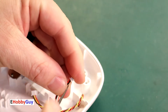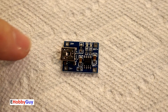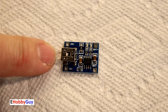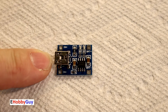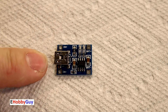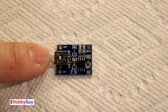I made sure to fully insert the metal portion back into the plastic portion of the connector so that when I plug it into the motherboard it seats properly. The polarity is now correct because I realized my mistake, but the damage was done. Getting back to the first of my two problems — charging the battery — the motherboard is not providing this function anymore. I'm going to introduce the TP4056 module, which I featured in another video. This module is designed specifically to charge 18650 lithium-ion batteries and protects from overcharging.